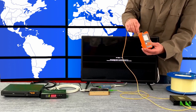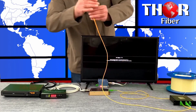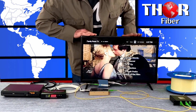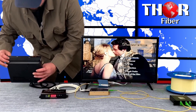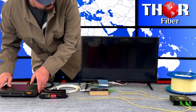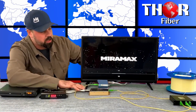Minus 5 dB is actually tremendous for our compact receiver kit which is right here. Again SC/APC, very compact, dual RF outputs. I'm just going to connect this in and this little red light should jump to green — and there you go. The TV is now showing the programming coming from the DVD player. This whole entire application from DVD to quad modulator to television is all being run over 10 kilometers of fiber spool.